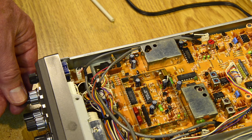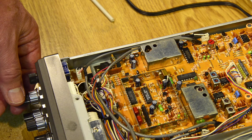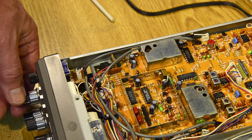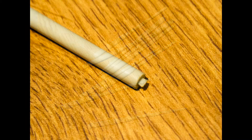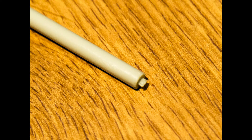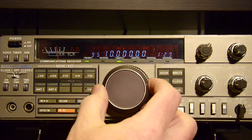It's taken some time — quite a bit of fiddling around to get it somewhere near where I wanted, but it's looking better. We'll put the cover back on and turn it right side up and have a look at what we've done. What should have been an easy job proved to be a little more of a nuisance and time-consuming than I thought it would be. I had 10 different types of plastic alignment tools and none of them seemed to fit, so I got one of them, altered it, scraped it, and got it down to a nice sharp edge so that I could move that trimmer capacitor around.